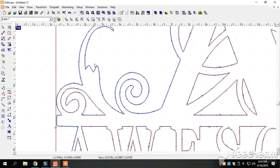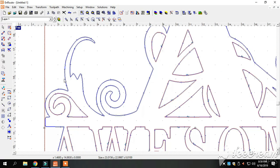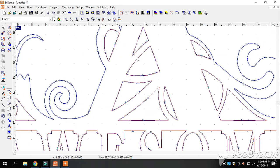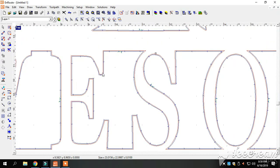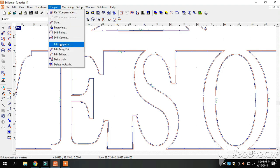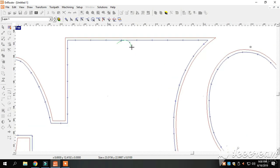There are our toolpaths. You can see they changed — you can see all the little arrows showing where the torch is going to go. You can see all the red parts in here — those are the ones that are going to fall away. When we put in our toolpath, I like to go in and change our lead-ins and lead-outs. Our torch will actually start right here, lead into the part, come around and commence cutting, travel all the way around, and exit out right here. Once the torch gets to that point it will automatically turn off and move to the next part.